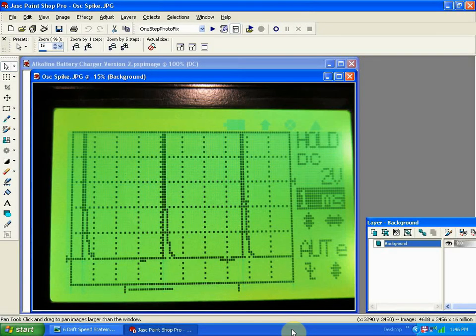Looking again at the voltage spike the battery charger is generating — keep in mind this oscilloscope shot is through a capacitor to widen the foot of the voltage spike. It is of extremely short duration, much shorter than I'm showing here. And the off time is considerable in relation — it's on for a very brief moment and off for a much greater period of time.